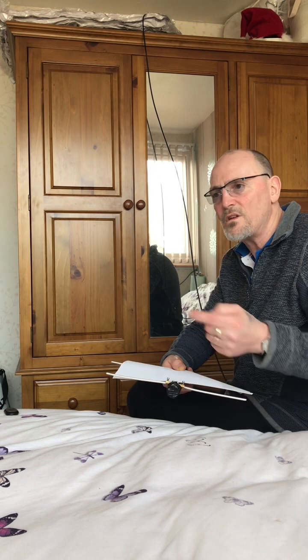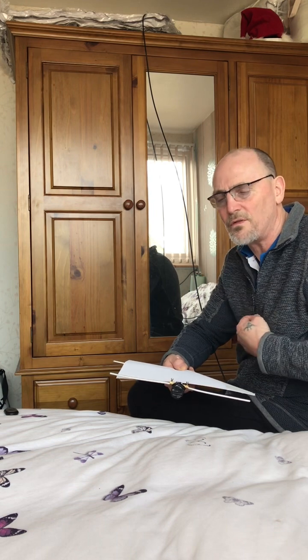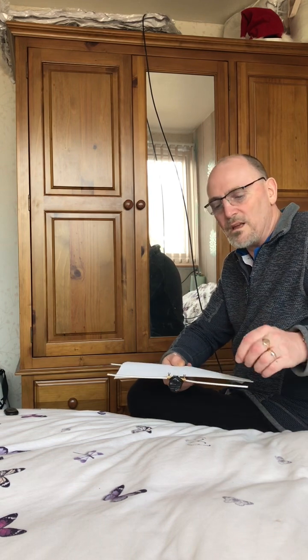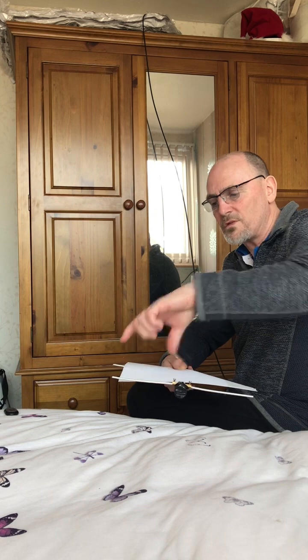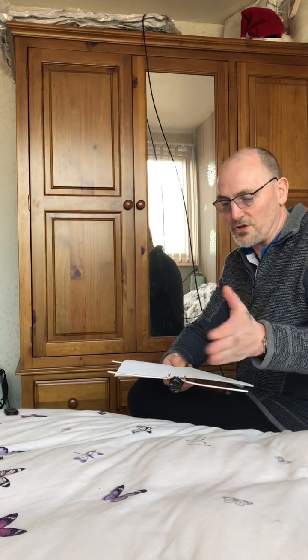A 2-to-1 is not particularly good. You're losing some power. A 3-to-1 is becoming, things are starting to heat up. A 5-to-1, you possibly blow your radio, and a 10-to-1, any operating at all for any length of time would damage your radio.